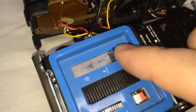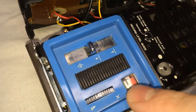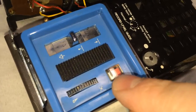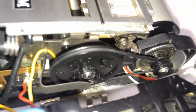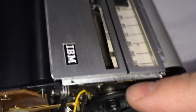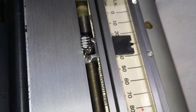As far as the controls go, to play back a recording you flip this to this position and you'll see that this meter here goes into the white area to tell you that you've got enough battery — so we're good. Now that we've powered it up, we have the correct action for the drive motor, which is encased in here, and that is now driving the playback and record head across the dial there, moving very slowly.